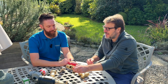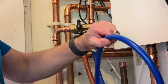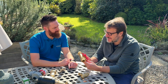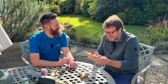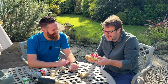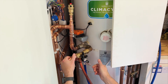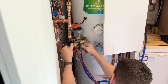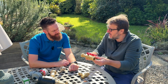You actually fitted one of these onto our system to get the air out of our underfloor heating system. It's called a fill and flush valve — quite a clever little tool. It worked tremendously well. You basically put the pipes onto the respective sides, force the water through from mains through the actual system. This wouldn't typically go on every system — you put it on ours because there was probably no other way to do that.